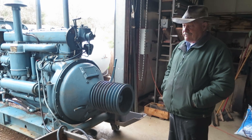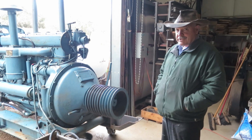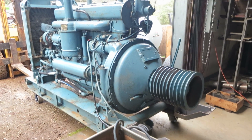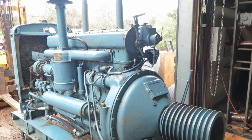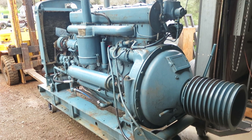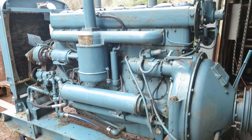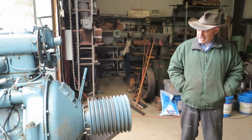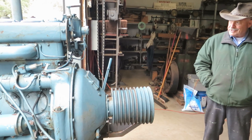This is a 1941 Murphy diesel — it's an ME66. The engine number indicates it is 1941, give or take. It's a 1,102 cubic inch, 6-inch bore, 6-and-a-half-inch stroke, 6-cylinder. Maximum RPM is 1,200 and it puts out about 188 horsepower, according to the brochures.